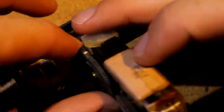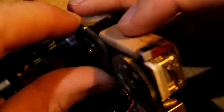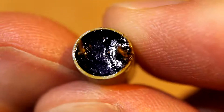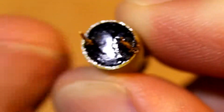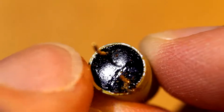I want to get the knob off of the volume/power switch and get some contact cleaner in there to work around the dead spots. I've gotten the largest and easiest-to-remove capacitor out, and there doesn't really seem to be any leakage from the bottom. There's a little bit of flux residue on this side from me desoldering it, but it looks to be in pretty good physical condition.